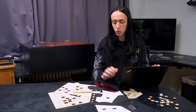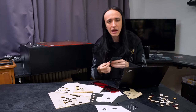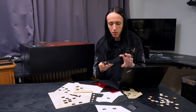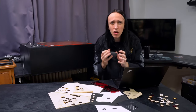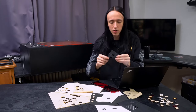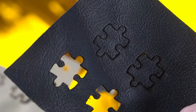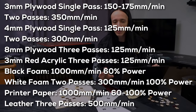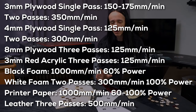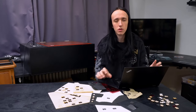Leather is actually quite easy to cut on any laser machine as long as you take quite a few passes. The problem is leather is a very organic substance — if you heat it up too much it starts shrinking and burning rather than cutting cleanly. Even with dark leather you want to move fairly quickly; otherwise it can almost catch fire and start burning more than actually cutting. I ended up doing three passes at 400–500mm/min, which is quite quick but gave really good results. If I moved down to two or one passes I would have to drop the speed way more than the power would suggest.